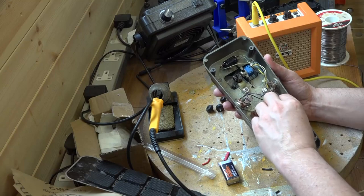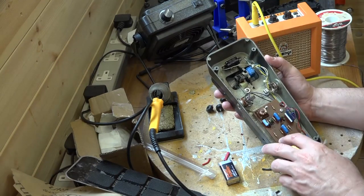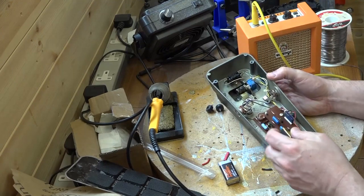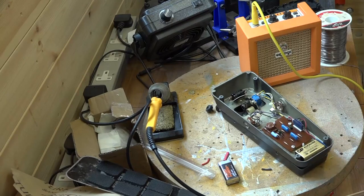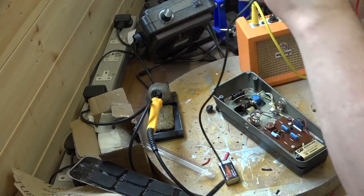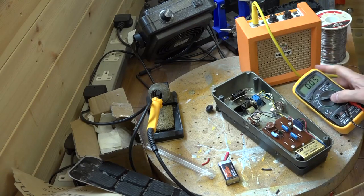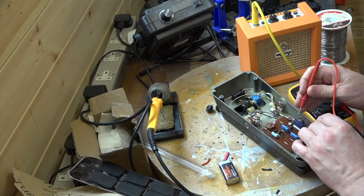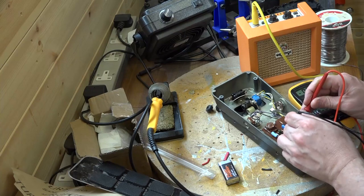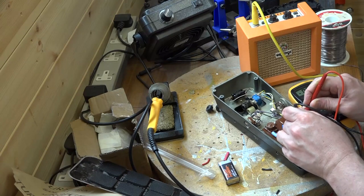There's a little connector here that joins the board and that could be loose. We've also got our battery here. So the first thing I'm going to do is grab a voltmeter — I'll just stick it on to 20 volts and put it across the battery input. It's showing eight volts — not a lot.